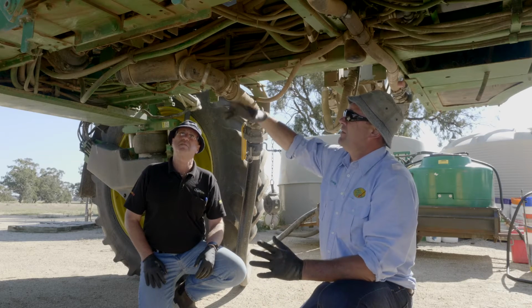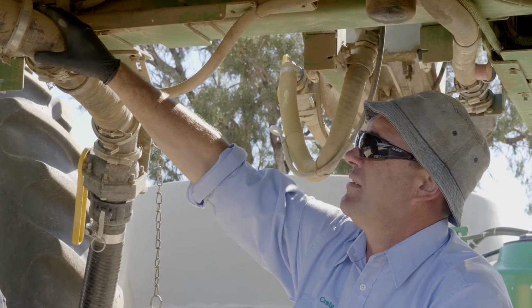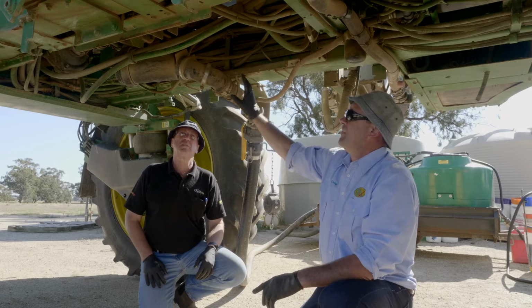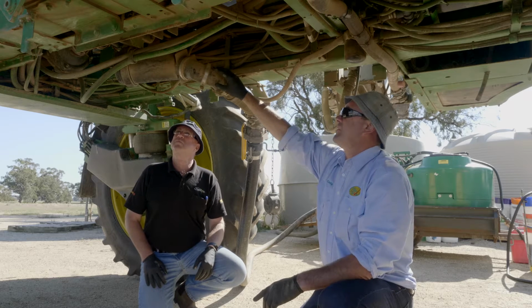So in a decontamination process, I would drain the pump, make sure we've got all that clean, paying attention to where material is going to hang in hoses. We're going to have to put a fair bit of fresh through this system to get that clean there.